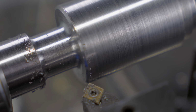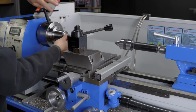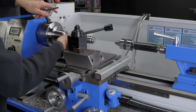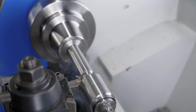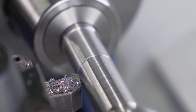The shank's diameter also needs to be reduced to 18 mm or so. That's to clear the bridges in the carburetor bodies. But I'm still going to leave the end at 20. I'm thinking, if I get some vibration facing the flanges between centers, that should fit my 20 mm 5C collet, or any of my other chucks. That's my fallback plan to get more rigidity.